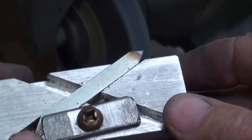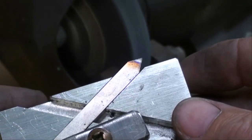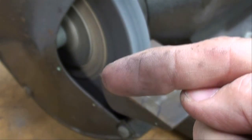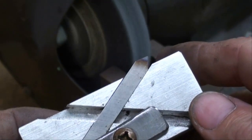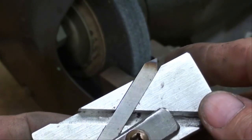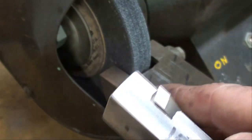Now be careful on the grinder. In my 35 years in a school shop, in a machine shop, I only had several bad accidents, and one was on the grinder. A boy took the tip of his finger off up to the end of the nail on a big grinder, and it'll cut it off just as clean as can be. It didn't even bleed much. So those grinding wheels can be wicked. Keep your fingers out of them and wear your glasses and goggles at all times.